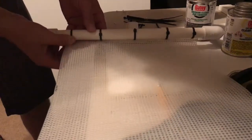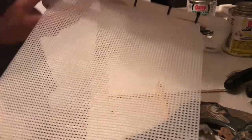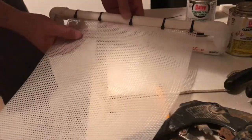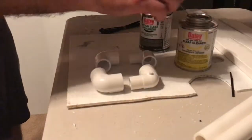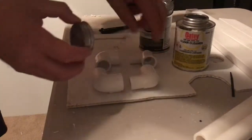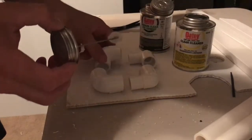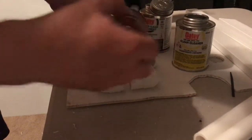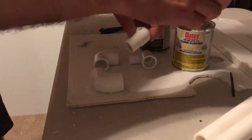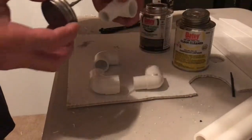I always position the zip ties where you're not going to get a zip tie cut, because then things are like ten times worse than a paper cut. I angle all those down where I won't have my hands during maintenance. I use clear cleaner versus the purple primer so it has a cleaner look to it — no purple primer all over there. I also time my fittings so all the barcodes are facing down or away from my line of sight when assembled, to give it a cleaner look.